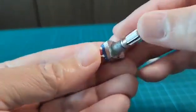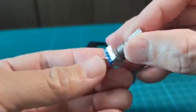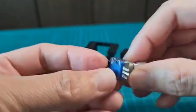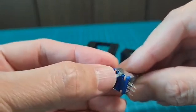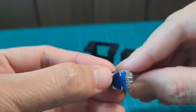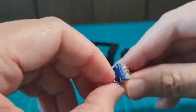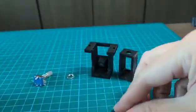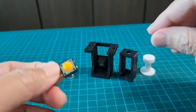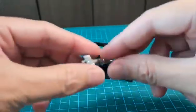For this rotary, you have to keep all five legs. These two legs are for the push button, whereas this one is for the left and right rotary. Ignore this bit here — it's for structural purposes if you need to mount this on a PCB.